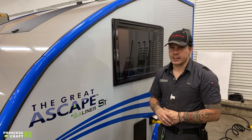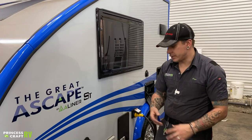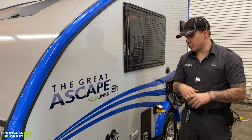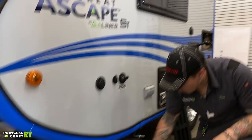If that is not high enough pressure for your liking, feel free to upgrade to a high flow or adjustable water pressure regulator. Just please keep in mind that we do not want to exceed that 75 psi water pressure. Those water pressure regulators all hook on directly to the spigot side of the hose. We then hook your drinking water hose onto the water pressure regulator and then ultimately onto the camper. Very important that we do always use a water pressure regulator. If one were to get lost, damaged, or stolen, please make sure you replace it before using the unit.